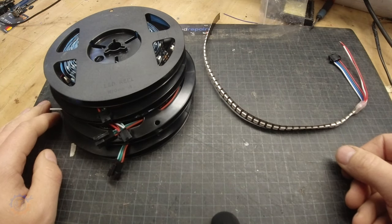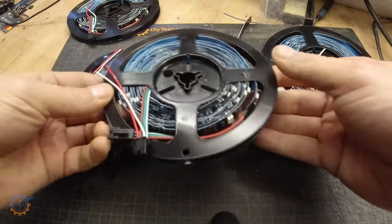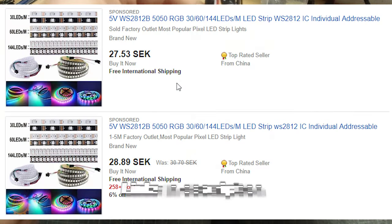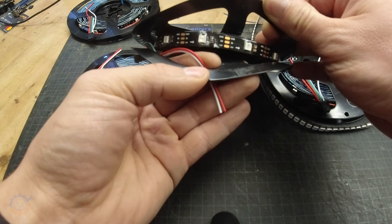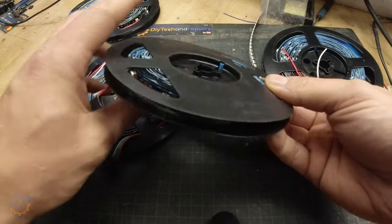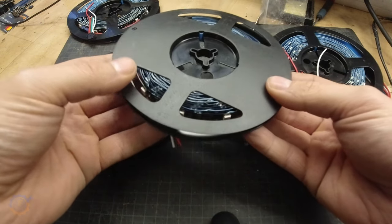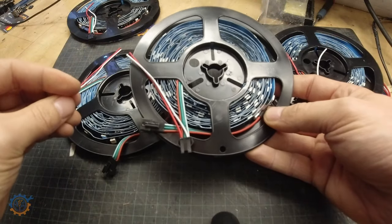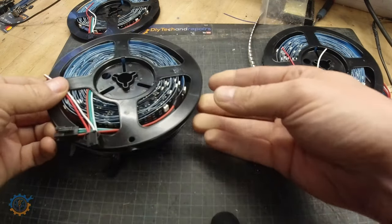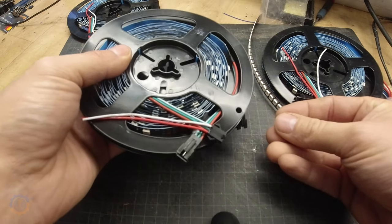Next up are LEDs — very important. I bought several more spools of LED strips. This here is the WS-series (link on screen). I bought the version where the LEDs aren't that close together, because I plan to have these RGB LEDs in the stairs — powering each step with PIR sensors so the LEDs go on and off as you walk up and down. This will be a really fun project and I'll post all the code open source, along with links, schematics, and everything. The device will also be wirelessly connected to my Node-RED server and controllable via MQTT.